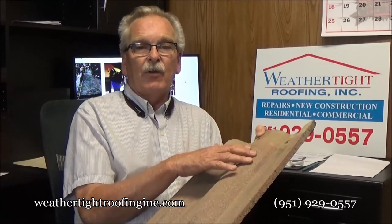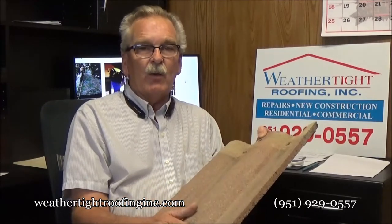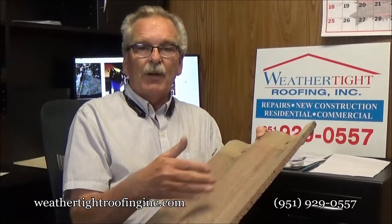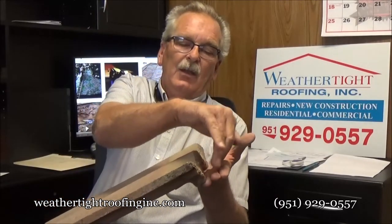So spend a little bit more money when putting a tile roof on — put two layers of paper on it. Elevated battens are another great option: they raise the tile off the roof and allow any water that gets under the tile to run off very quickly, so no moisture sits on the roof. Debris doesn't build up under the tiles either, because when it's on an elevated batten system everything washes right through.